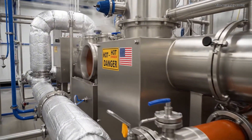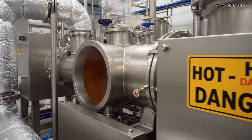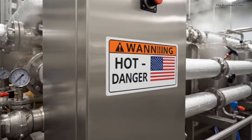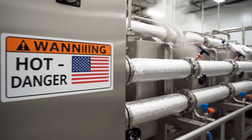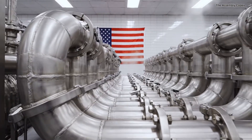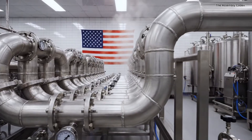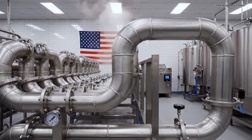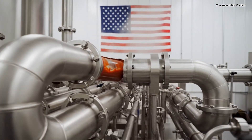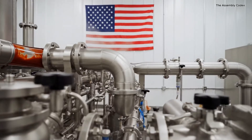The thickened sauce is pumped into a final tubular heat exchanger. This is the pasteurization step. The hot sauce flows through a long coiled stainless steel pipe designed to keep it at the sterilization temperature.